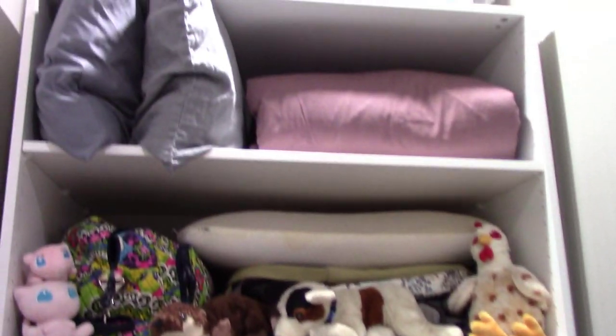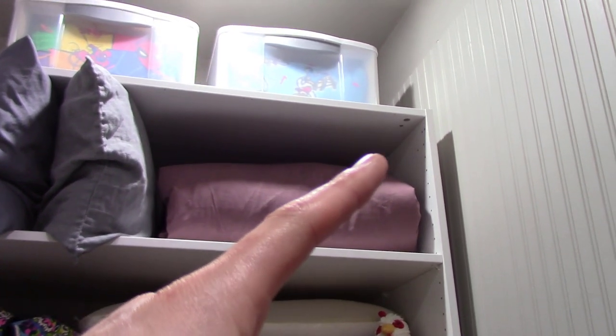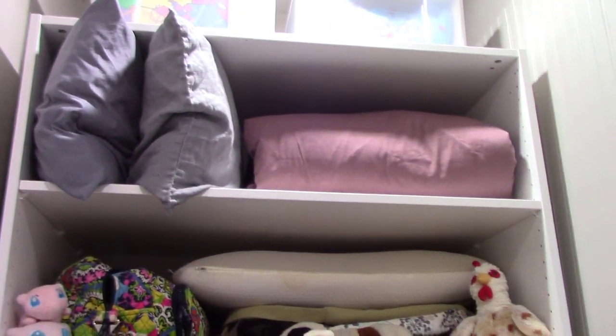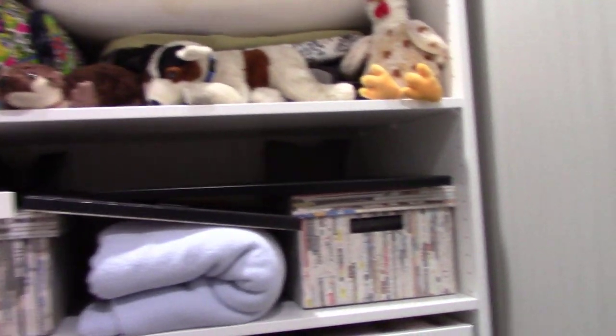But luckily we had enough room at the top to where I could bend out the sides again very carefully without tearing out those anchors in the chipboard, and was able to get the top piece installed. Now, with these cheap IKEA cabinets, the way they hold their square and structure is by a backing board. You can see on this other one, it's a thin piece of hardboard really, but that's what keeps the square.